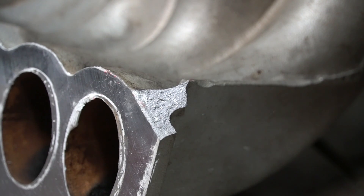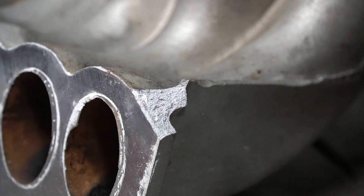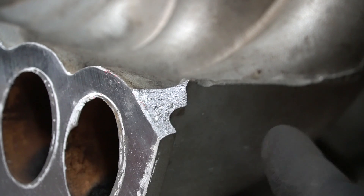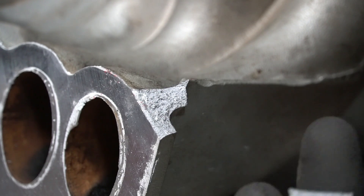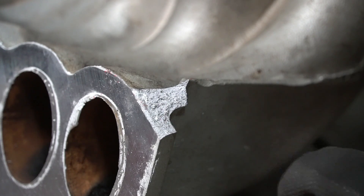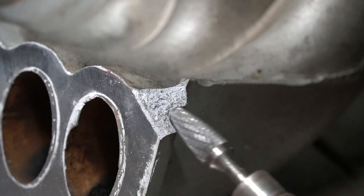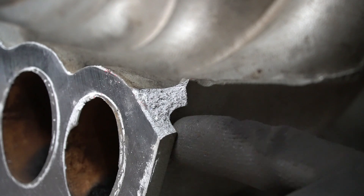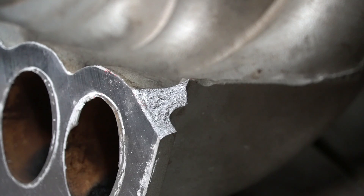This is kind of why cast aluminum just plain sucks to weld — it's very difficult to do. When you look at it you see all this grainy kind of structure as it broke off. All of that is different purities of aluminum — it might even be different metals. You'd never really know what the manufacturer used. Generally it's a lower purity, lower grade aluminum. During casting it's made in sand or some compressed mold, and as the metal flows through, stuff breaks off and gets stuck into the metal itself. Not to mention this thing is like a metallic sponge — it literally just traps air. So as you're welding along you'll see all kinds of stuff literally just break free and jump into your weld puddle.